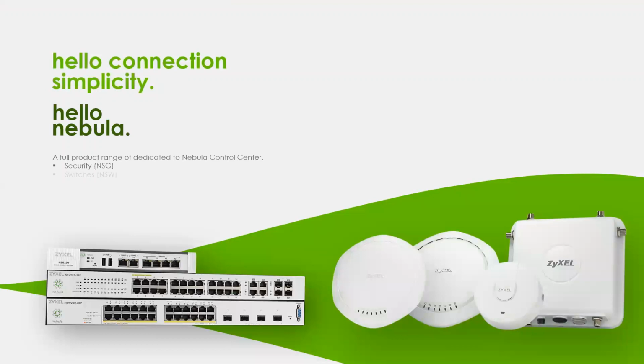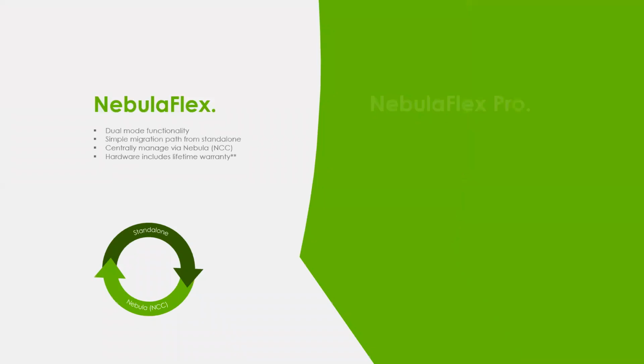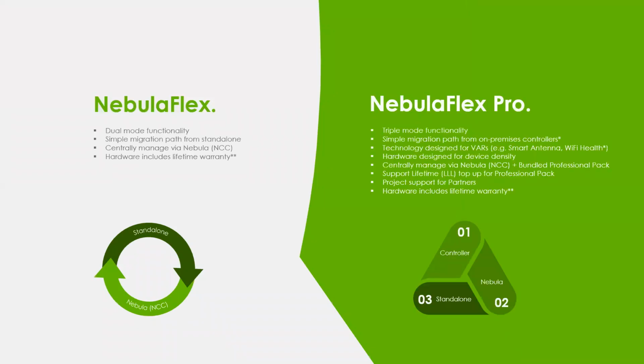So Nebula is available on our security gateways, specifically the NSG series of gateways. It's available on our NSW switches and some other models we'll get to later, and on our access points. So when you're looking at stuff, you will see some products advertised as Nebula Flex. So what Nebula Flex does is that tells you that this device can be used the traditional standalone method of network management, or it can be used in the cloud, either way. So if you see Nebula Flex, it lets you know it can go either way.